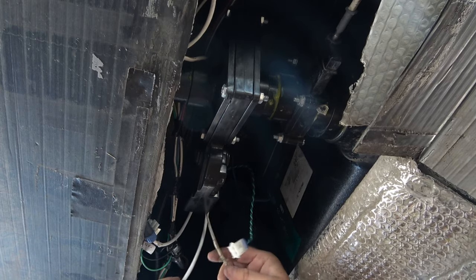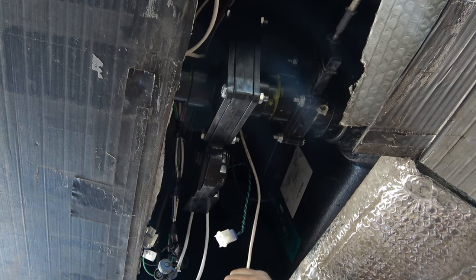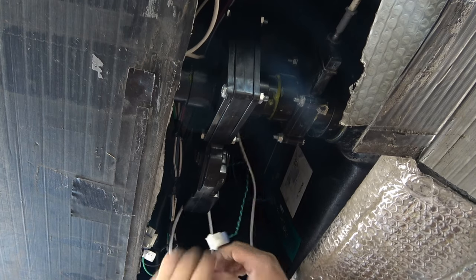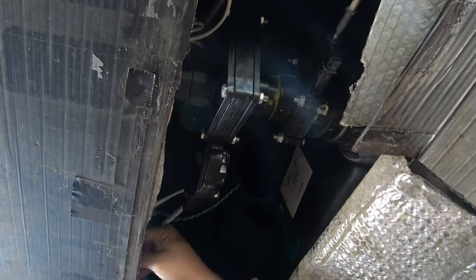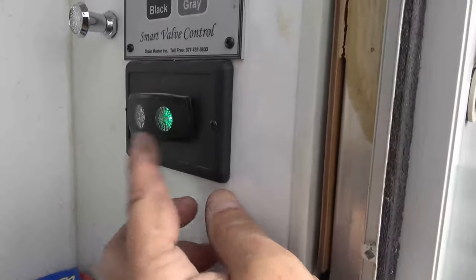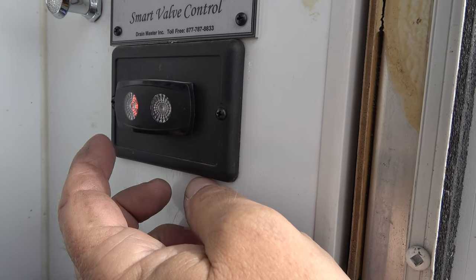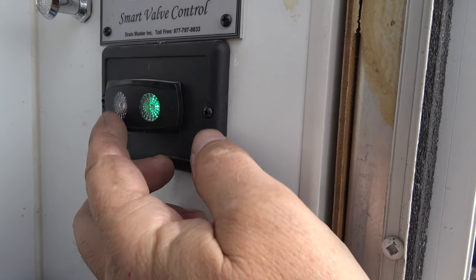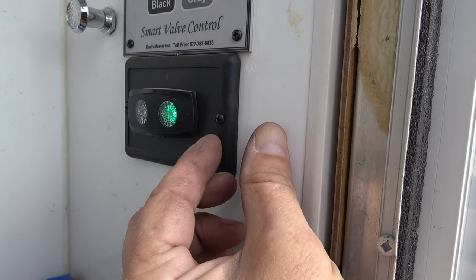Let me just reconnect the data cable. We got a green light — let's go see if she's opening and closing properly. We've got green — that means closed — and red means open: green, red, green, red. So that means it's going all the way open and all the way closed. If the valve doesn't make full travel, one of those lights won't come on. Looks like we're good to go. Now I just need to check for leaks — open that other valve and give it a try. No leaks with the tank fairly full.